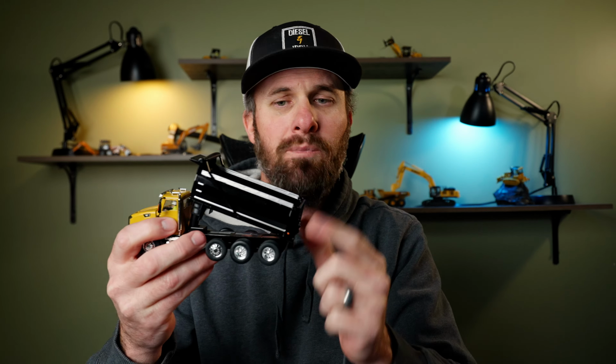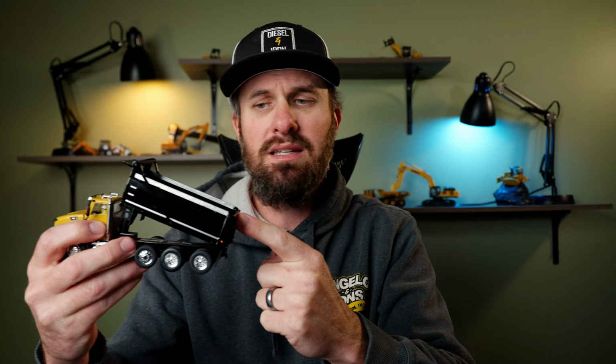And now we're going to find a spot on this truck. It's probably going to be a little higher on the tailgate here where that hinge is, because again, now we're applying force to the frame of the truck, not just to the tailgate. So we're going to hit him right up here and we're just going to track forward nice and easy as the truck is trying to pull forward. And 9 times out of 10, that's going to get you out of your spot.